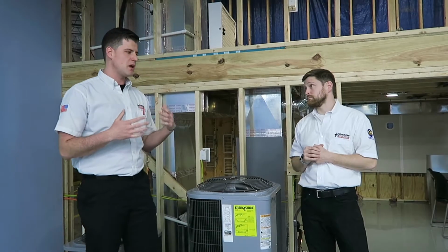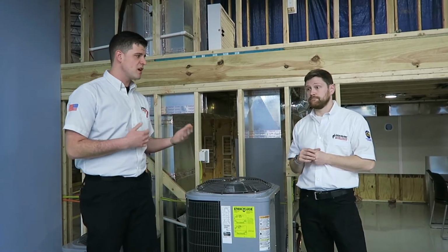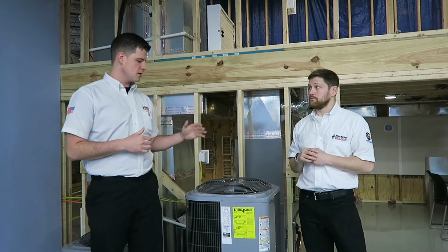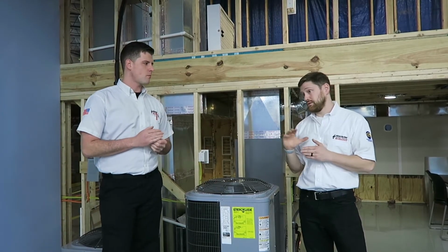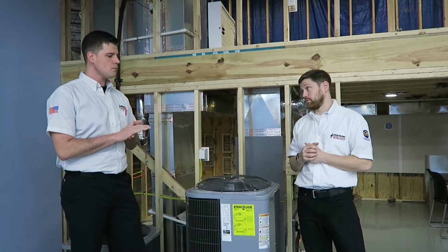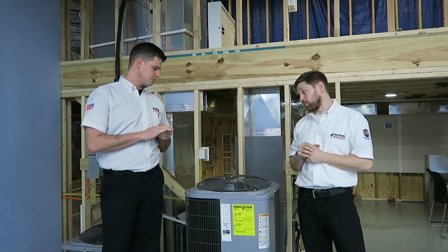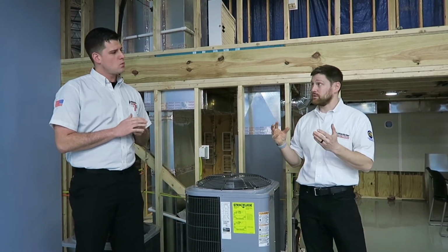As far as spring maintenance, an ideal time would be somewhere around probably May. Yeah, end of April, May time frame to start getting your air conditioners cleaned. When the weather warms up and it's consistently in the 60s, 70s outside, it's a good time for us to come out and go through and clean everything, check all the parts on it, and then that way we can actually get an actual reading of what the refrigerant levels are at.